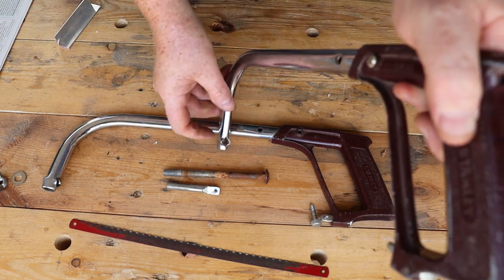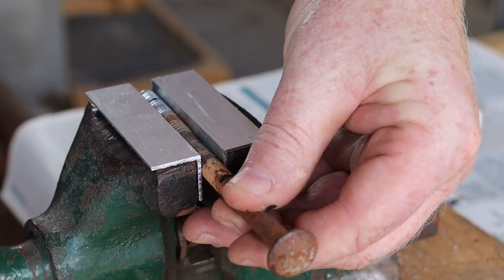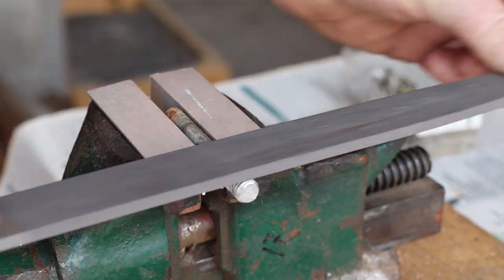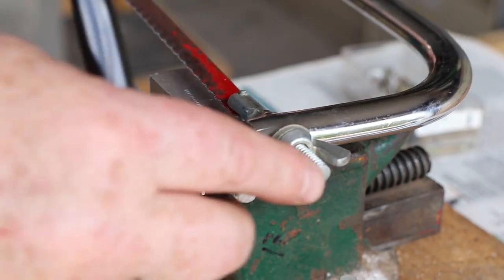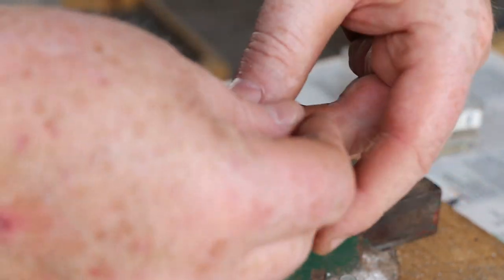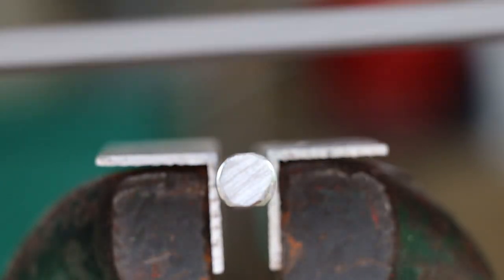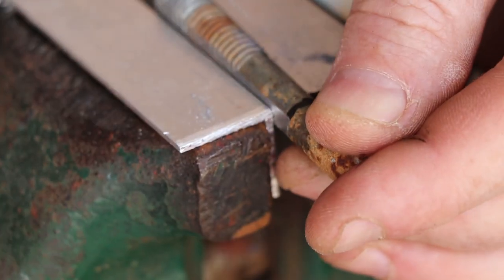It's a bit longer than we need but I'll just saw off the extra length. The hacksaw frame has a square hole in its end to match the square bolt. I'm going to use the factory bolt off the first hacksaw to mark the dimensions for our new bolt, then cut the donor bolt to the correct length. Once the bolt's been cut to length we can flatten its first side with a file — use long strokes and lift it off your work for the return stroke. The flattened section needs to be a specific length so I'll mark the donor bolt and keep filing.